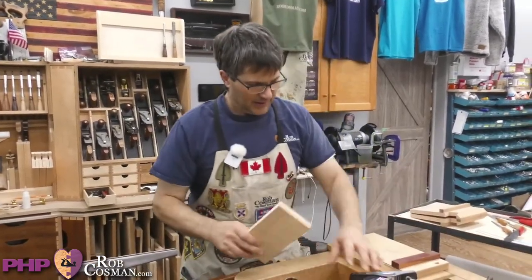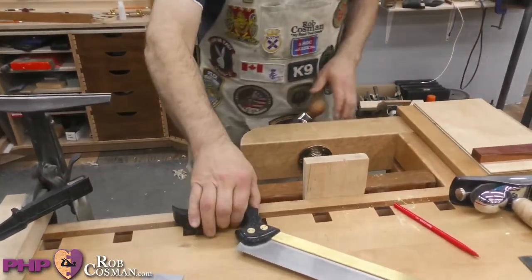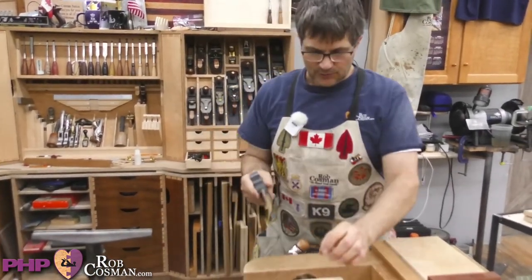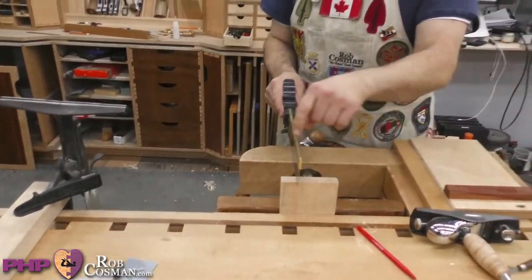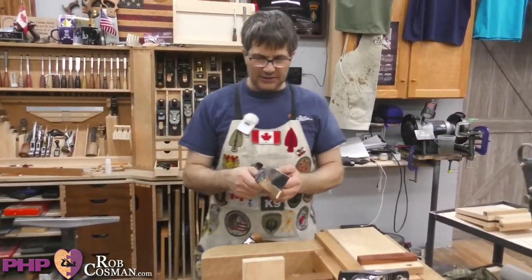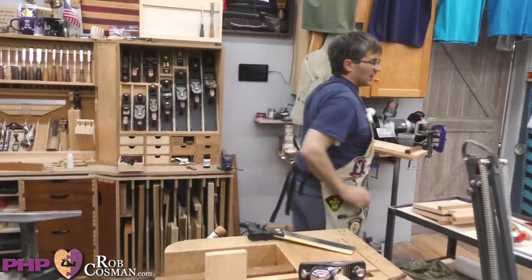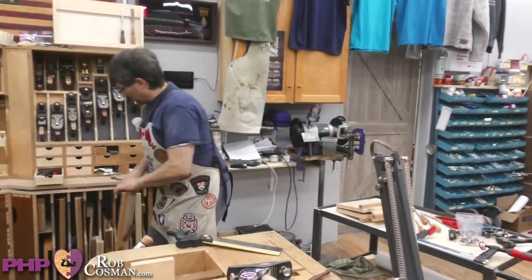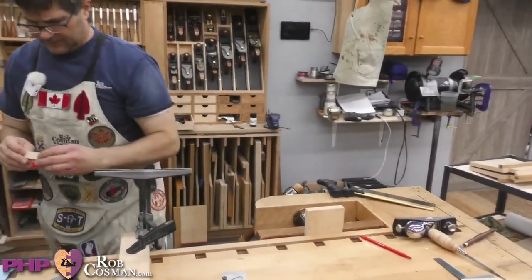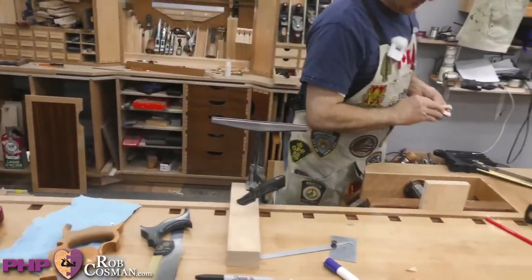Well, let's say we had a 16th of an inch bow deviation from straight, front to back, over a 10-inch blade. Even if we're in 1 inch of wood, if you do the math on that, it's hardly detectable. But I understand people want it to be straight. So you can easily straighten it. And the easiest way to do it, since you don't have a saw hockey skate straightener like we do, is to take two small pieces of wood. I'm going to use these. Take two pieces of wood like this